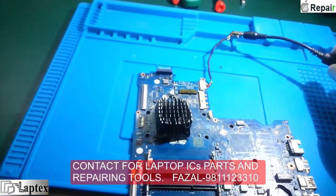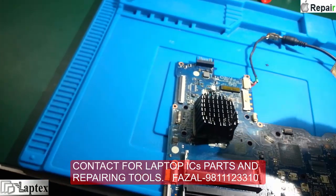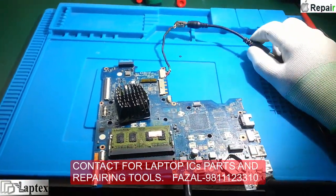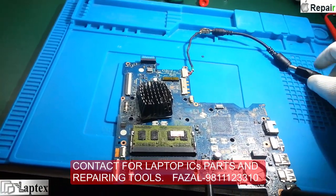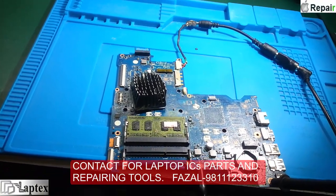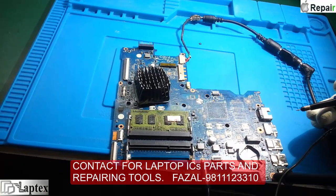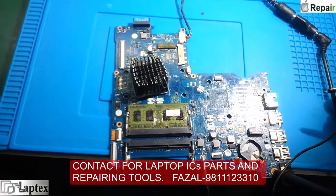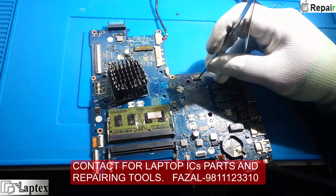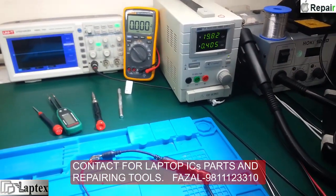The display might come - I'll have to check it with RAM. One very interesting thing: the voltage was not dropping when it was getting off - the suspend voltage was not dropping. I hardly get to see such kinds of problem, so this is a very unique case. That is why I made this video so that you do not get confused.